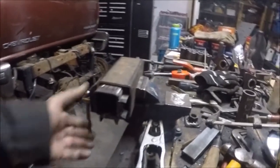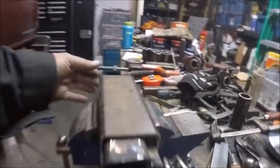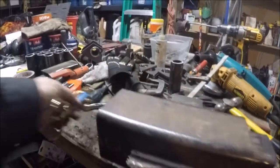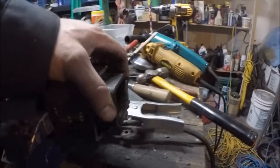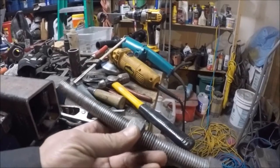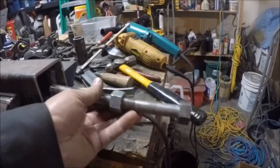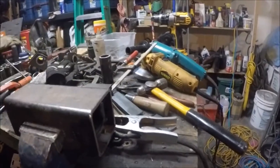I don't expect to have to move this more than two or three inches max to tighten up the track, and I'm gonna add some holes in the side — these pins are gonna go through just like this. The amount of torque on that front wheel bent the front bracket when I tried to break one side. The way the old slider worked was a piece of three-quarter-inch rod held the adjuster back with just a nut. Once you put a couple thousand pounds of force on that I don't want to bend it or bind up the thread, so I'll use this to tighten it, stick the pin in the closest hole, then back the nut off and lock it — that way the weight is on the pin and not on the bolt.